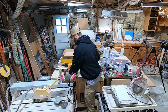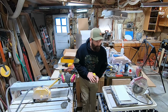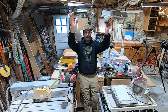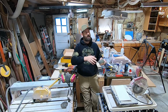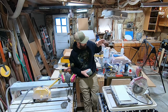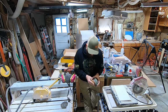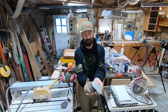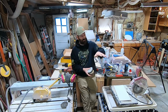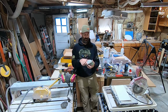What about glass tile? So all this will cut through glass tile. Something you're going to need is to polish the edge of a glass tile. Before I started doing YouTube, I remember I had a shower where there was glass mosaic, back when people were actually putting glass mosaic in their house. And it was in a bathroom and it had a stripe that went down the wall across a bench and then down to the floor. And on the edge of that bench was a cut. And luckily, I was prepared. I've got tons of polishing discs to polish stone, polish quartz, granite, tile, glass. And I was able to put the smoothest, buttery edge on that glass so no one was cutting their ass.